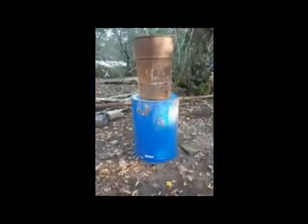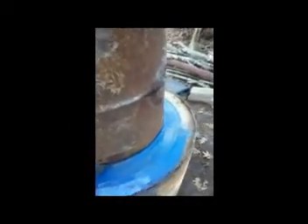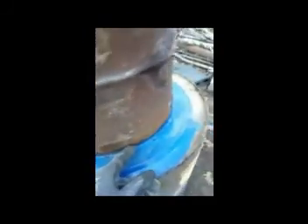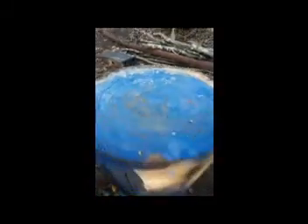You can see I got this barrel on top of the other barrel just to see how they line up. I went to mark here, and you can see this barrel already has some rings — a ring nearly the same size as the other barrel. I'm going to cut a hole in here and make some flaps — tabs that bend up — then I can screw it to the other barrel, and I'll have a hole here the same size for air to flow in, rocket stove style.